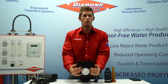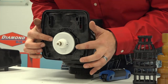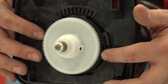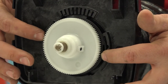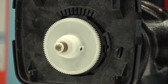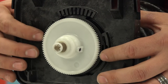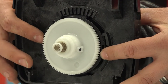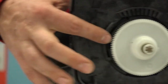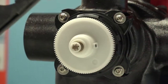That exposes your back plate. On your back plate, you're going to find two tabs. Some older systems do not have these tabs, so you'd just use a small flathead screwdriver to pry them in. On the newer ones, they're easy tabs for your thumbs or fingers. All you do is squeeze them in — one on either side — your back plate turns and comes right off. Set that to the side; you don't have to worry about damage to that.